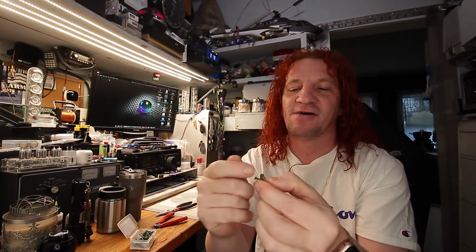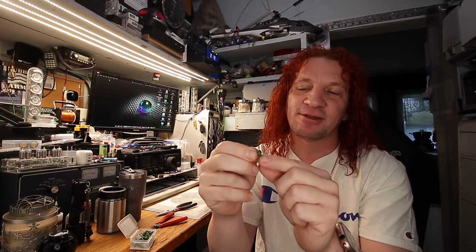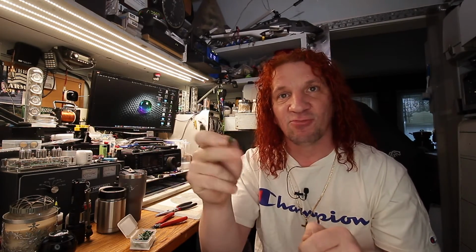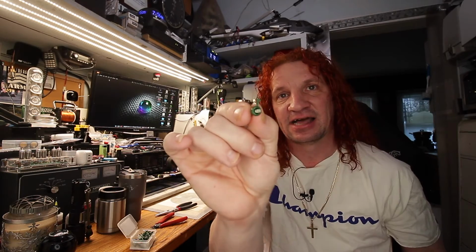And then you can unfold the wires here, push the LED out. There's a little spacer in between the legs, the wire legs. If you can salvage that and put it on a new LED, more power to you. If not, you can just sink the LED all the way in and fold the long wire. On an LED element, there's a long wire and a short wire. The long wire goes on the same side as the light lock. So it's very easy. You always have the correct polarity, unless the light lock is broken. And then if it doesn't light, flip it over.